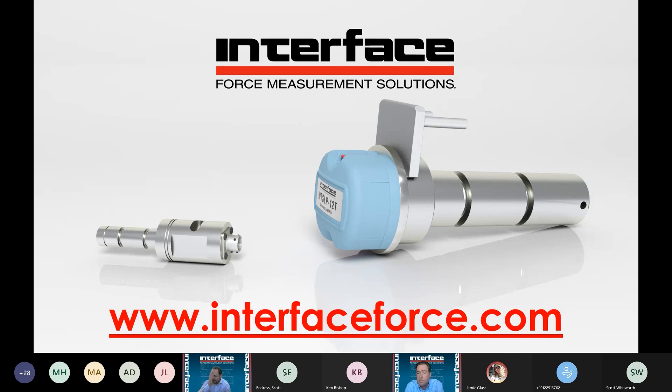Speaking of performance, the key is that we want these pins to be operating in double shear — we do not want them bending. We talked about material hardness and radial tolerances. If you have soft reaction surfaces or things that allow for a lot of slop, or if the load is not evenly distributed across the different pin surfaces, you can end up in a situation where the pin is more bending rather than having the three components held and loaded through a double shear. The tighter you can keep the pin in a double shear, the better performance you're going to have.